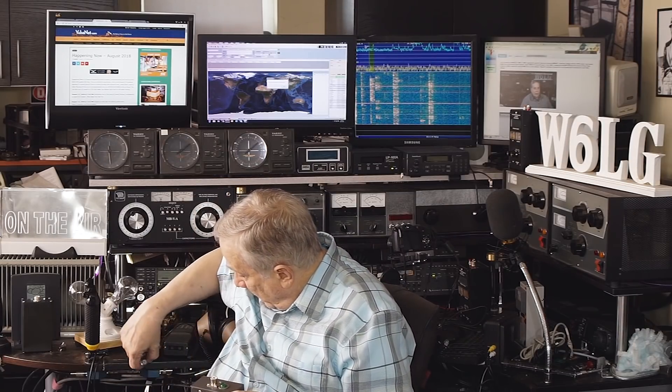I used an SO239 on the top. I did put in a panel light to indicate circuit voltage — I'm not sure how useful that is, but it's good to know when it's on and off if running on batteries. I found a potentiometer in my junk box; value of the pot, 10 to 25K, something like that. The reason I used an SO239 on top is just about anything will fit in it — it could be a length of wire, an old whip, or with an adapter, a rubber duck.